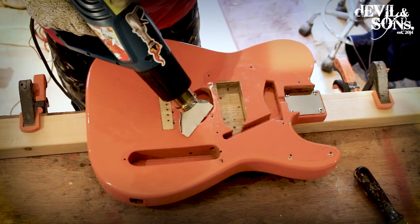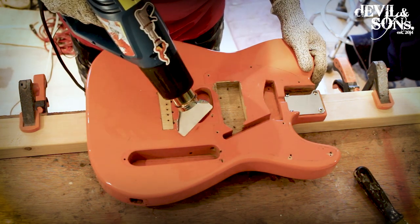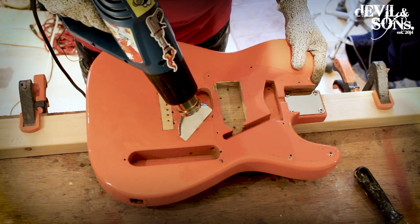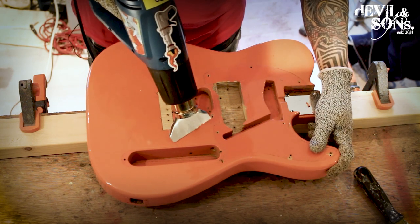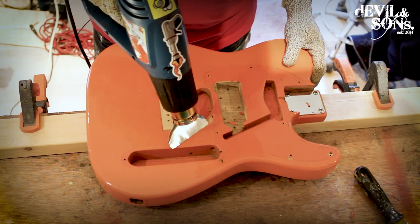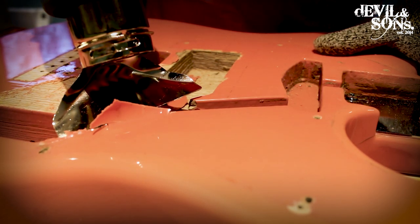So here I'm just going to talk over some clips of me working in real time so you can see how long it takes. Initially what I'm doing here on the first part — the top of the guitar — is trying to heat up an area to focus on. I've just turned up the heat because I felt like the heat gun wasn't giving off enough. If you see an orange or red reflected glow from the filter on the body, you know it's too hot — it might burn the paint or the body. When I'm applying a bit of pressure, I'm trying to get the edge of the scraper on the heat gun to slide under a bit of paint and peel up the whole section. The paint's getting hot and so is the scraper. From another angle you can see that idea of getting a corner under a piece and slowly peeling it back — sort of unwrapping it, a bit like when you're peeling an orange.